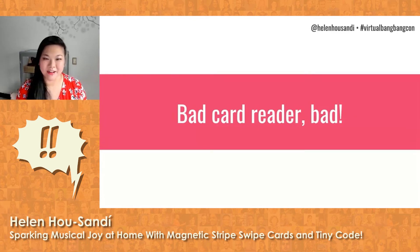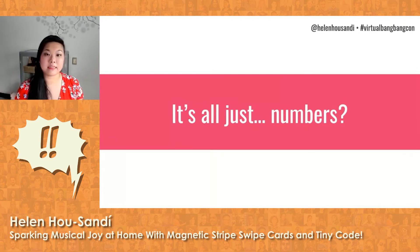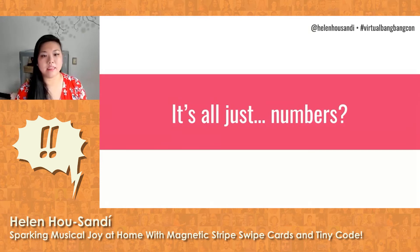This would become even more evident way later on after everything was done, because it occasionally sends ghost output and will randomly start tracks. I went to a couple of stores nearby looking for a new card reader, but I couldn't find one, and nobody at those stores knew where I could even find something like that. So I did what all coders eventually have to do: I hacked around it. Magnetic stripe cards typically have three tracks of information, the first being able to store the most data and the second and third only being able to hold some numbers. I tried encoding Spotify URIs onto the first track, but between the card reader not reading the first track and Spotify URIs being case sensitive — which if you didn't notice, my name was in all caps — this was a no go. My buggy card reader actually sent me down the right direction because otherwise I probably would have tried to figure something out involving the URIs, since I was sort of mentally stuck on that.